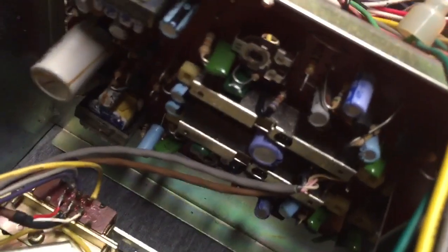And let's see, there was another thing I was going to show. Oh, these two switches you see here, those two long silver things. Let me hold one camera here, and then I can point. Yeah, these guys right here. When you press record, this entire metal piece goes forward and pushes on those big, long selector switches. So it changes the mode from recording to playback, or vice versa.